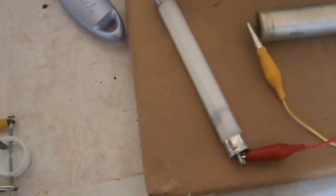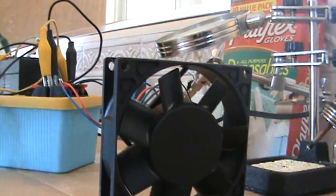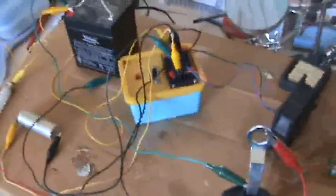One way to avoid trouble here is to short out the spark gap — put the screwdriver across here. You'll notice the light is glowing but it's a little bit dimmer, and now I can remove this without getting zapped. So be careful with this stuff. There's some interesting phenomenon happening. Bye.